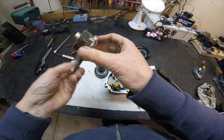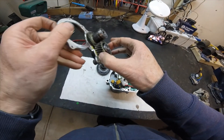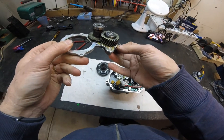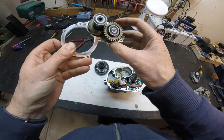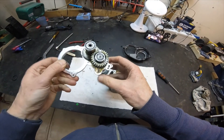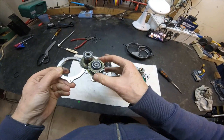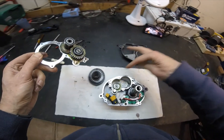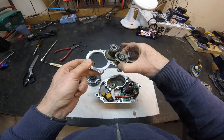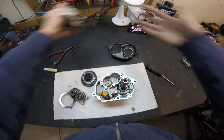To change the bearings there will be a little bit more work involved — you're going to need some specialized tools to remove the gears since the bearings look to be pressed on. That's not a straightforward job, but not difficult either; any machine shop could do that for you. If someone wanted to go back to a plastic-geared version to make it quieter, I can't see why that couldn't be done. My plan will be to re-grease this drive, making sure there's plenty of grease especially on the secondary gear system. Being encapsulated inside that area means the grease will be well maintained on the gears.